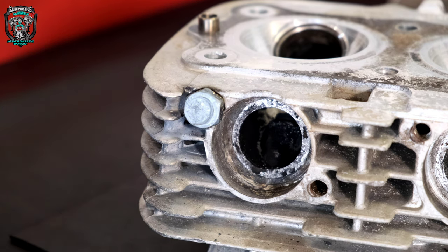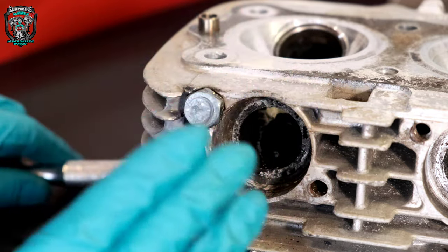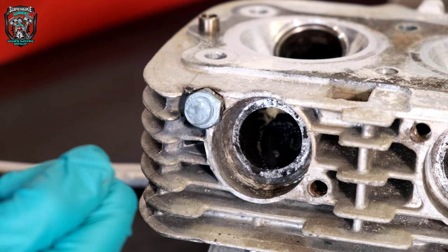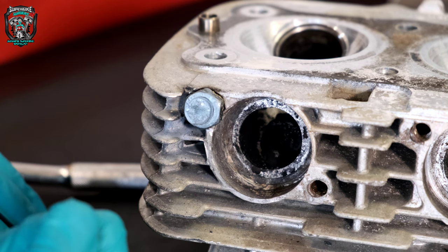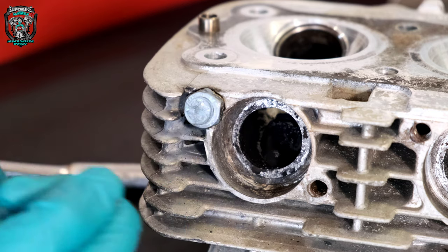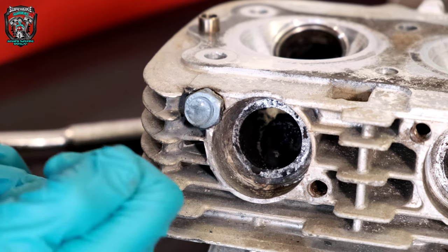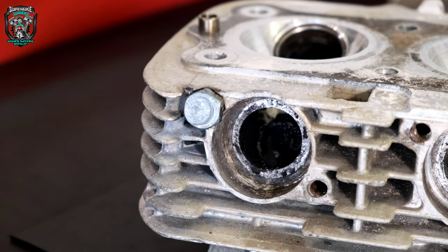So you can see what's happened here. With the TIG torch — sorry I couldn't get you an arc shot close-up, my camera just freaks out if I go near anything I'm welding. I was on about 100 amps — not super hot, but this is a big massive heat sink. You basically want to hold the torch on there and work that stud, turning the top of the stud into a weld pool so it sinks down into the nut. Then liquefy the inside of the nut as well so it's all one big weld pool, and fill it up. You can see how well it's flowed into the nut.